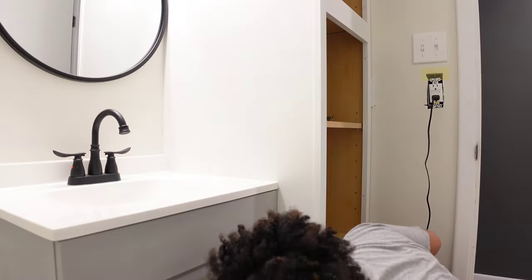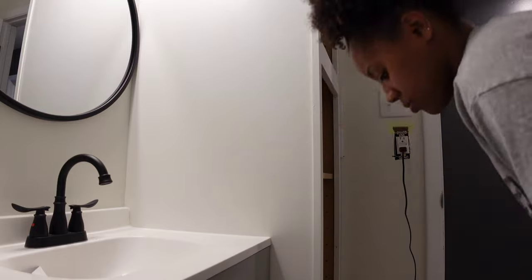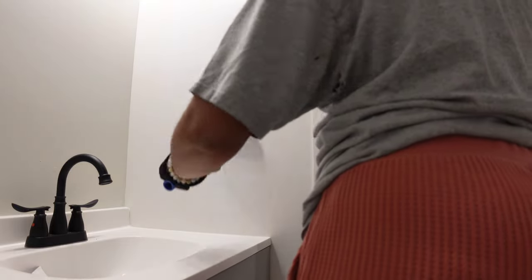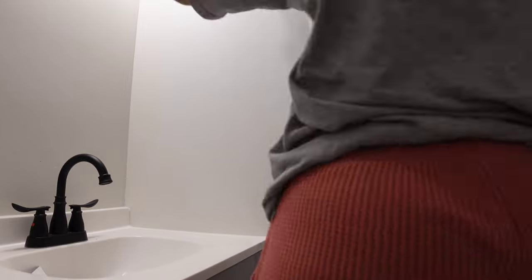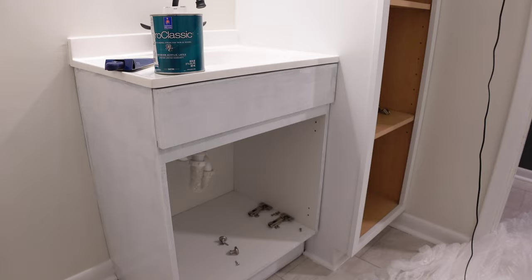These are laminated cabinets, so they have this kind of sheen and shine to them that can make the paint a little difficult to hold on to. So with me sanding and roughing up that surface, it's going to help the paint grip onto the cabinets. I'm also going to go in with a bonding primer to help hold that paint in place, and I'm hoping that will help with the longevity of my painted cabinets. I've painted cabinets before — I did my kitchen a couple of years ago, and I'll have that tutorial linked. I have primed both cabinets, two coats, because I wanted to make sure this was going to be durable.